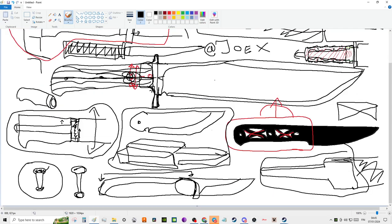But folding knives are super interesting, because if you're talking about lateral forces like chopping and batoning, and you're not talking about actually bending it, and sometimes even bending is fine, it's amazing how strong they actually are, and how often they're stronger than full tangs. I've noticed some blade constructions where, if you don't have too many unnecessary components in the handle, it's pretty solid, homogeneous material. It's unbelievable how strong folding knives can be, because there's no tang to really break off. It's already broken off, the tang.